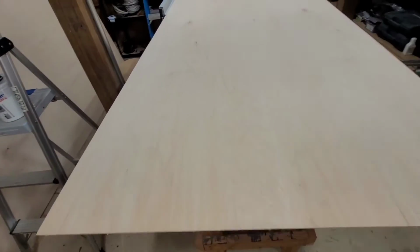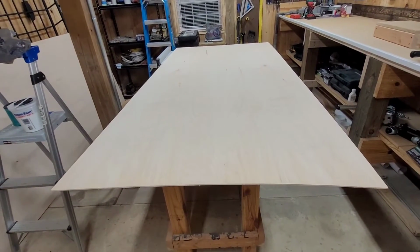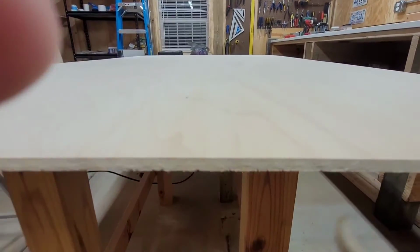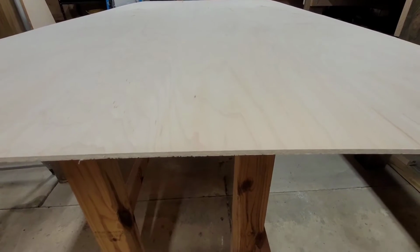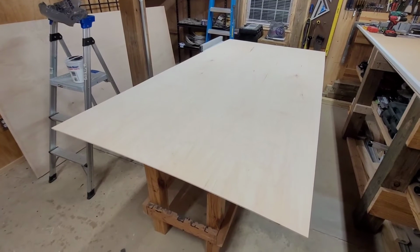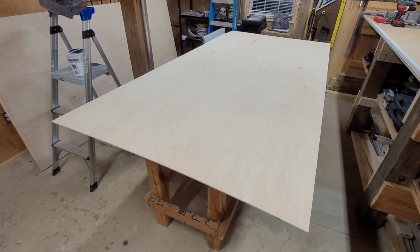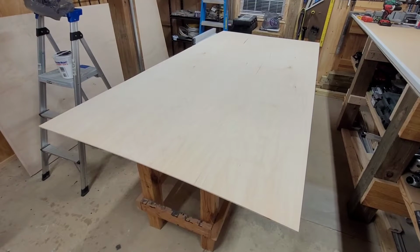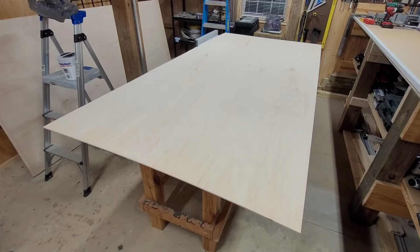And I did one of these before and put the paint on with a paintbrush and then kind of wiped it off with a rag afterwards. And it didn't turn out so well. Part of the reason I think is that this plywood, it's not true plywood. It's got a real thin little layer on top of a mixed, ground up sort of material, almost like a pulp. So it doesn't absorb very well. And the other reason I don't think it worked so well the first time is that by putting it on with a paintbrush, it would dry in certain spots before I could wipe it down.